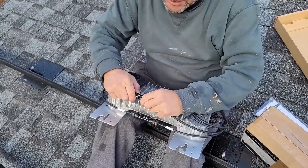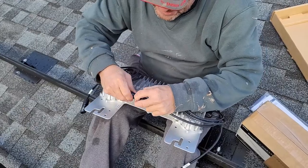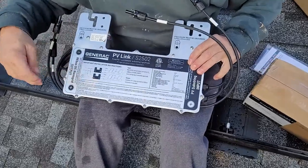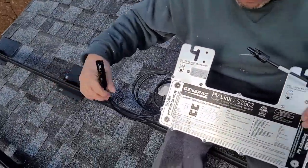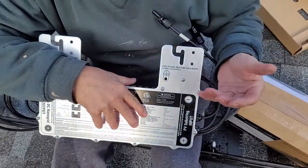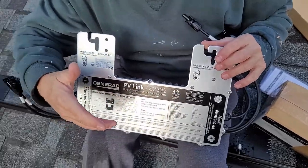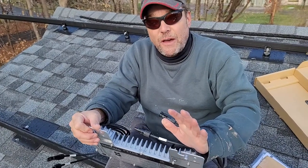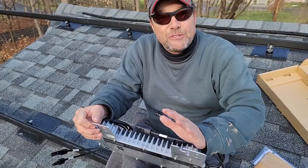What this is, it's got two different ends. That's the output — this end is going to go down to the inverter for Generac, and this one is the PV modules coming in. How many you can hook up in a row depends on how many watts they are. We're using 325-watt modules. This is a 2,500-watt unit, so we can use up to seven modules per string.